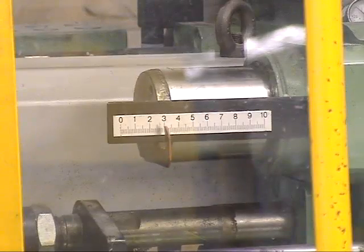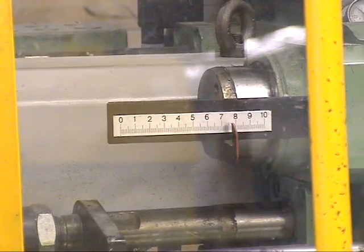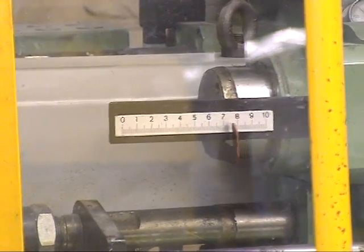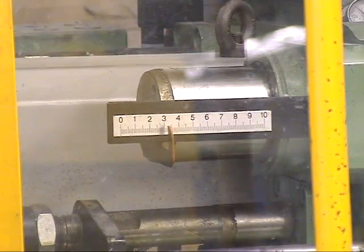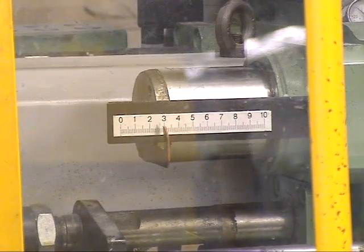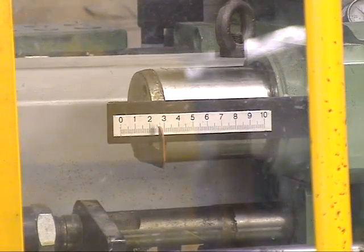During the injection cycle, the screw first rotates and then moves backward as the plastic is melted. It then moves forward at a specified velocity to fill the mold. Once the mold is filled, the screw piston switches to pressure control, and the additional forward motion, called packing, is caused by the plastic compressing in the mold before it hardens fully.